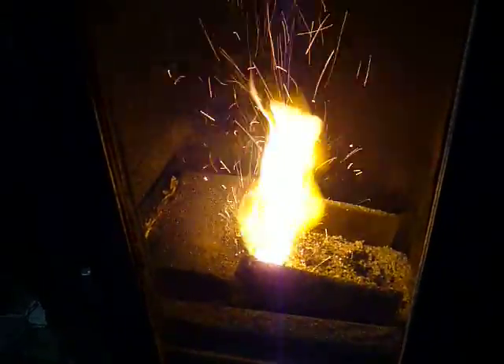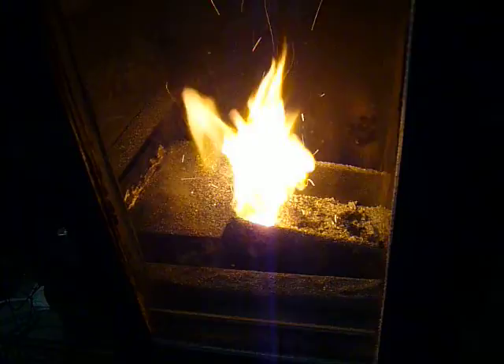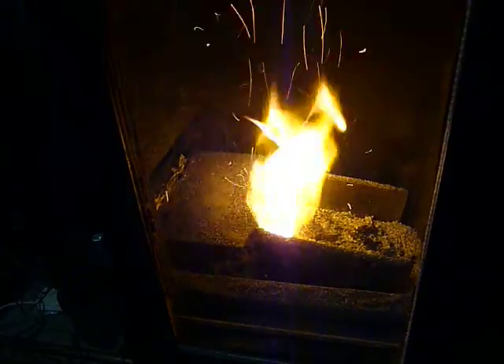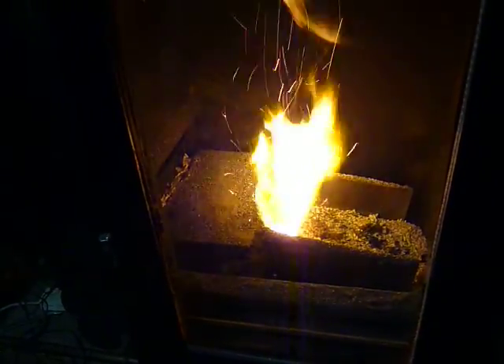That plate you see sitting over the top of the bed, just behind the fire there, ensures that any gases that gas off the head of the flame are pushed out through the flame. There's another plate below it that makes sure that the coal, if it does clinker on the bed, is pushed down and doesn't try to bunch up behind the clinker. That works really well — it just allows it to push straight through.